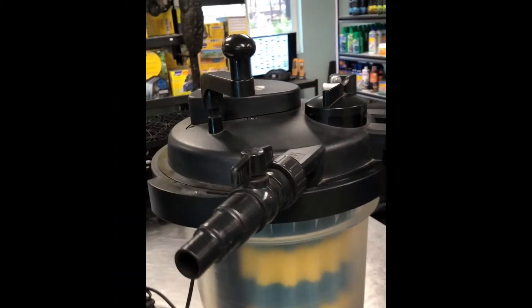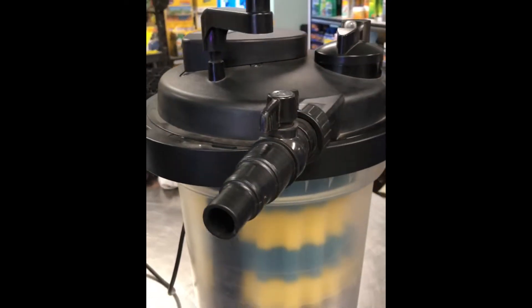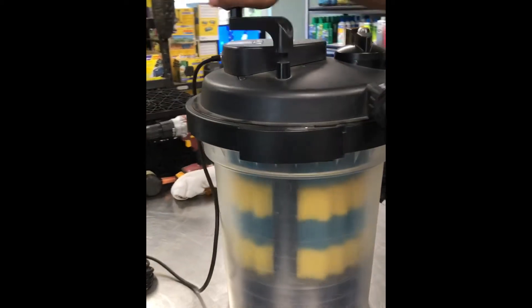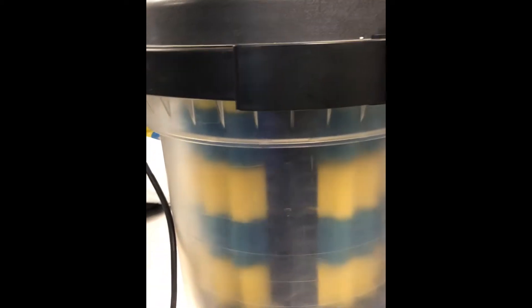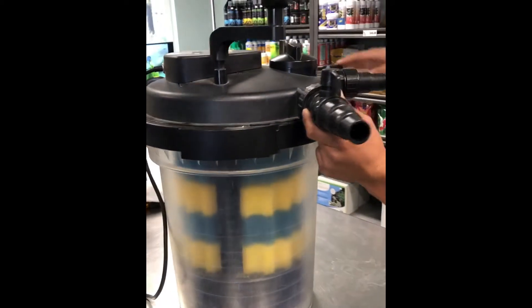What's special about this filter is when you have water coming out during backwash, it's coming out like chocolate milk. You backwash it with the crank — what it does is it spins and squeezes the pads, helping get all the dirt out of the filter, and it'll spit out of your backwash line.